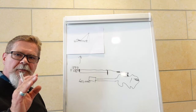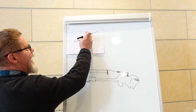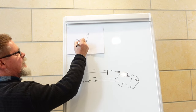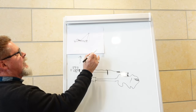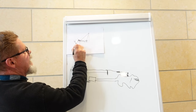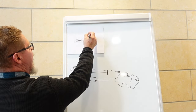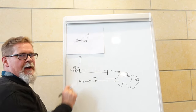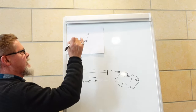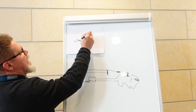Now, when you pull into a rig site, again, you're not going down the freeway with your poles in the air. They are headached. Now, to raise those poles, you put slack in the number 3 winch, you let that out, and you pull on the number 1 winch. So if the poles are here, and you pull on the number 1 winch, they will rise up and be controlled by how much slack is in this winch line here. If this is tight, the poles will not want to go up and you have all kinds of tension going on. That tension ends up being manifest first in this block and then in this one.